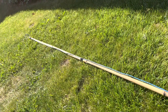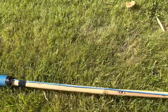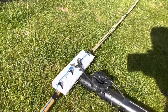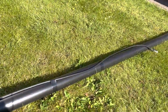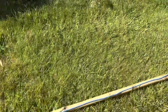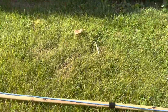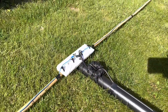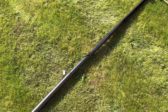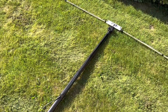Along the boom, temporarily taped on, under that tape I've soldered on the coil, and then there's another four foot going to the end of the boom with a little bit of overhang — a couple of inches — that I'll get trimmed off when we tune. This is the driven element, the same on that side. I just need to create a centerpiece, attach it to the mast, and do some tuning. We're going to trim symmetrically the ends of the driven element, making it shorter each time, getting onto the desired frequency — probably 14.2.